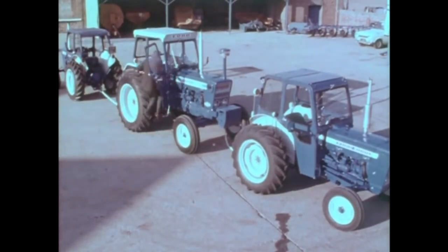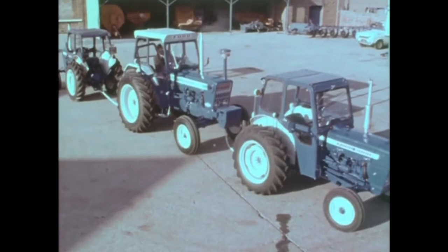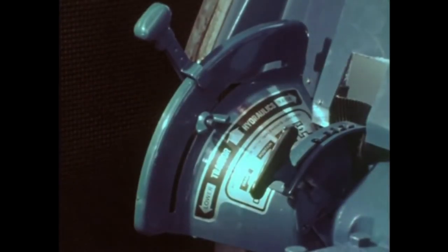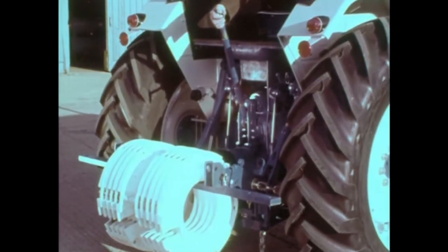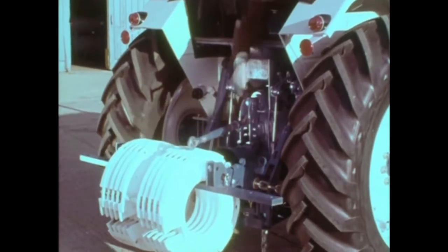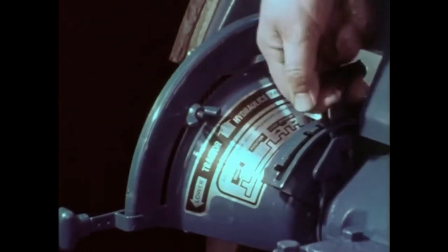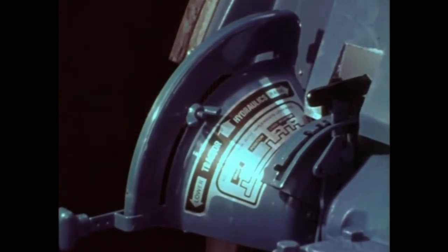On all Ford 7000 tractors, position control, top link draft control, and load monitor system of hydraulic power lift control are incorporated. And selection is achieved by moving a convenient T-handle next to the quadrant lever. Top link draft control is simulated here by compressing the top link against the yoke, thereby activating the raising cycle. Removing the pressure allows the system to assume the lowering position. It's a simple matter to select any one of three load monitor sensitive positions.